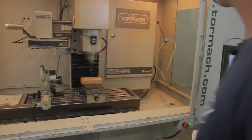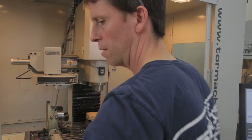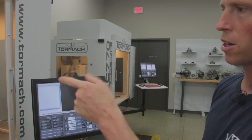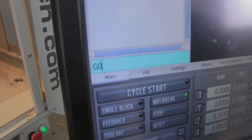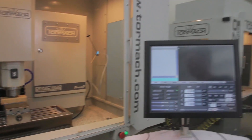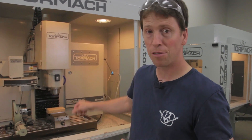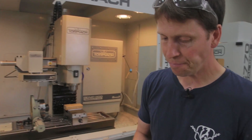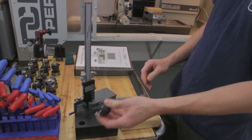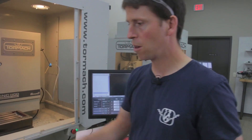Now we have a condition where if I wanted to go to that zero point, I could just type in G0 X0 Y0 Z0 and it'll go right down to the spindle nose on top of the workpiece. So now that we've set X0, Y0, Z0 to be the top center of that workpiece, I'm going to go ahead and touch off my tools. We're using two tools for this routine. We want to measure these tools beforehand, otherwise we'd have to stop the program in the middle to touch them off. There are a number of ways to do this, covered in another video on tool offsets. We could use a height gauge and manually enter the values, but the manual covers doing it without that equipment, so we'll use the machine itself to measure the tools.